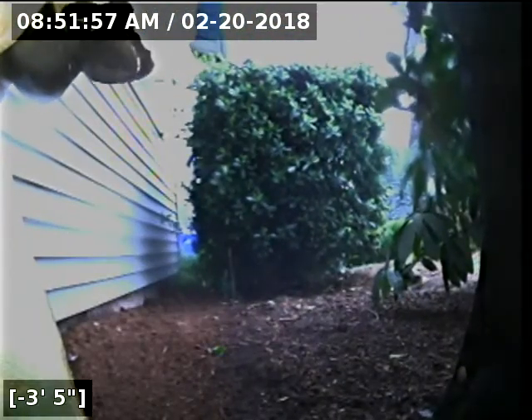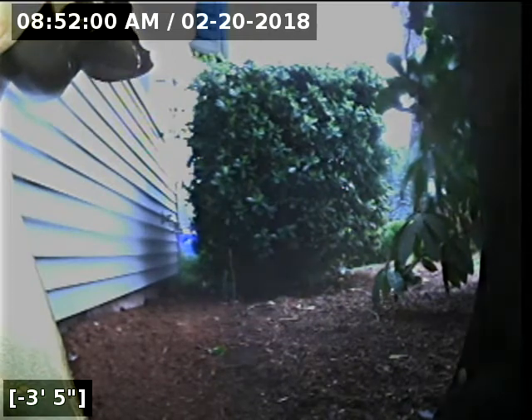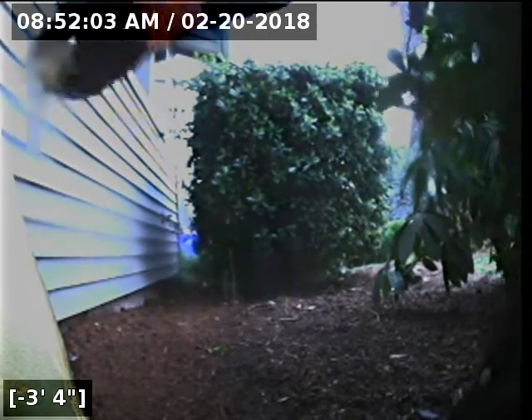As you've seen with me going to and from the main on the North Street, there are no issues for concern. There are no indications of any cracks, holes, root intrusions, no offset joints, no bellies in the line retaining water. This will be a passing sewer line camera inspection for this property. The drain water is flowing freely without obstruction to the main. I will have a written report and this video upload for you and your realtor to view. Thank you for choosing Lantern Inspections.